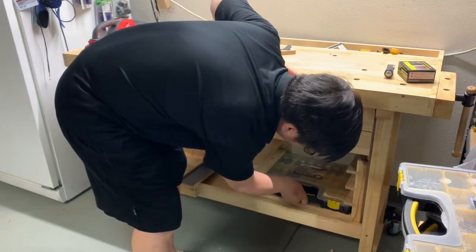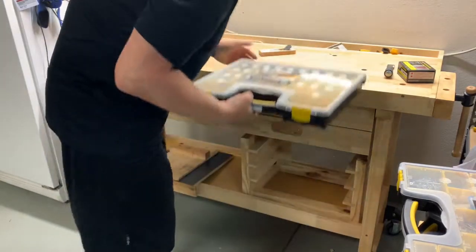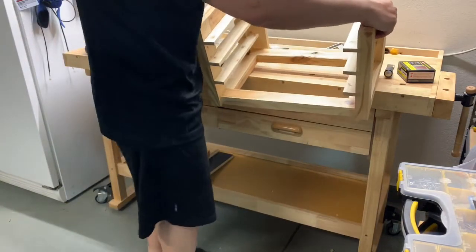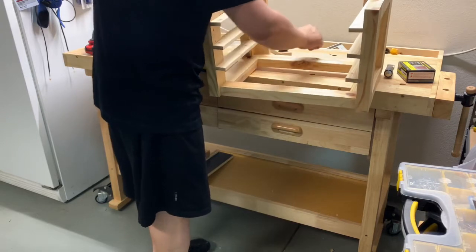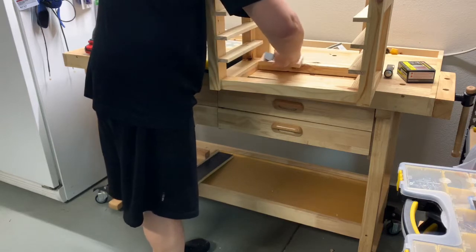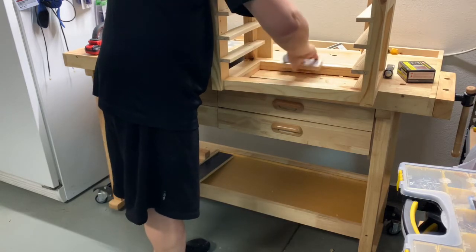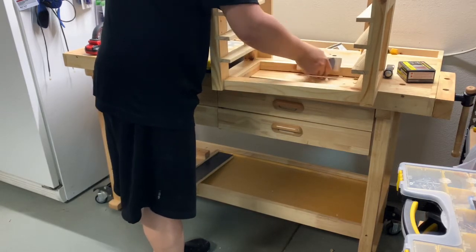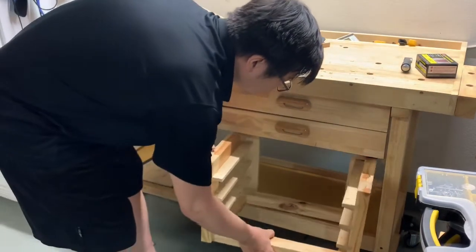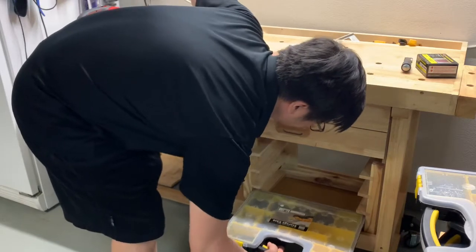I ended up moving the rack to the other side of the lower shelf since I'm right-handed and figured it'd just be easier there. I noticed when sliding the bins in and out, the very bottom shelf kept catching — poor planning or a poor glue-up that left the back part of the frame a little higher than the front. I just took a block plane and shaved it down to make it smooth, and that fixed it. All the bins now slide in and out fairly easily. Just make sure all the pieces are flat and aligned when you glue the rack together.